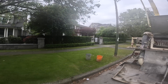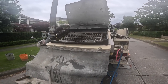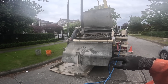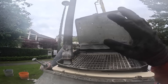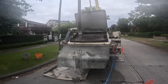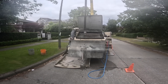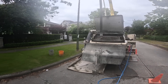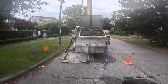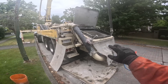All set up, got the code to get in the house. I've got a 20-foot two-and-a-half-inch hose off the boom, running my secondary screen, so chances of plugging that hose are basically zero. When the truck backs in I'm going to prime through the hose, cycle it around with a long hose double-ender, slowly checking for air, making sure we have flow. Not going to hammer this through - nice and slow, because that first bit of mix out of the truck can be a little rocky and inconsistent.